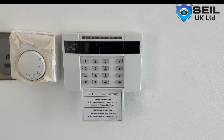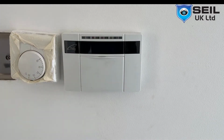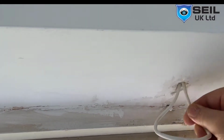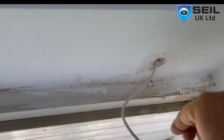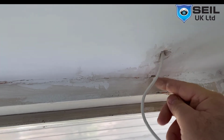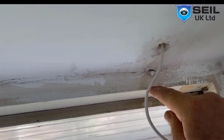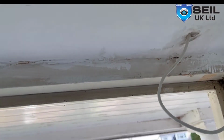Then let me start on the door contact. This side is finished, so now we go to start the door contact. So the cable is in, stuck on, the builder is doing. So I need a little bit of chase here, and I put my door contact here, yeah. Main here, then the magnet on the side here, yeah. So I'm going to show you the magnet.